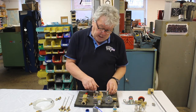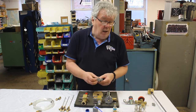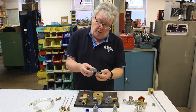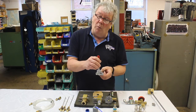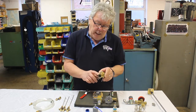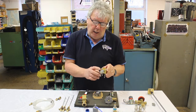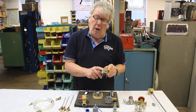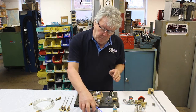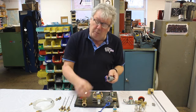Running alongside the Müller traditional valve, we have a quick shutoff valve. A quick shutoff valve is a quarter turn valve, screwed through the flange adapter. The handle is in the upright position when the tank is open and turned across when it's closed. We also offer the Rego traditional outlet and the Teema outlet. Depending on the hose coupling on the burner, it will determine which one you use. A dust cover is available for each of these valves to keep debris out.